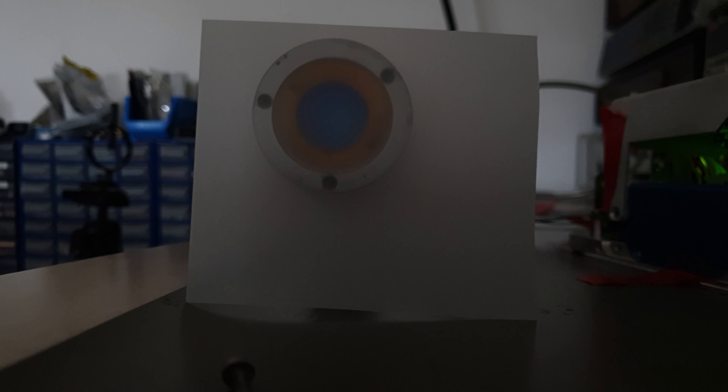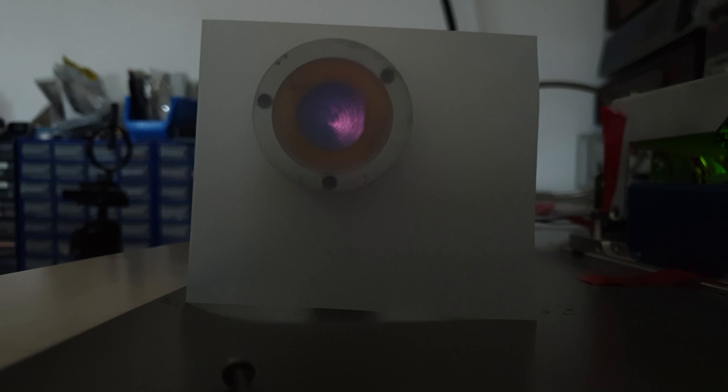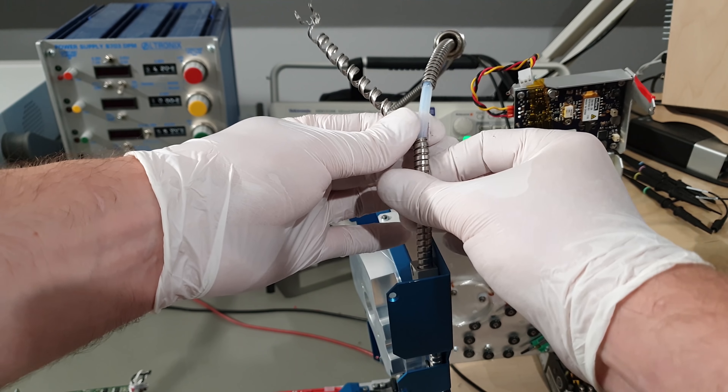Now we can gently start to give it some power. I ended up finding the user manual for this thing, so I can now talk RS-232 to it, configure waveforms, amplifier current, and pulse frequency. This is what they call standby state, where a configurable simmer current goes into the amplifier. The higher that's set, the more ready the amplifier is for suddenly starting stimulated emission — like this, where 50,000 pulses per second are being emitted by the seed source. It's cool that nothing is smoking and something is actually coming out, but that beam is neither round nor centered very well.